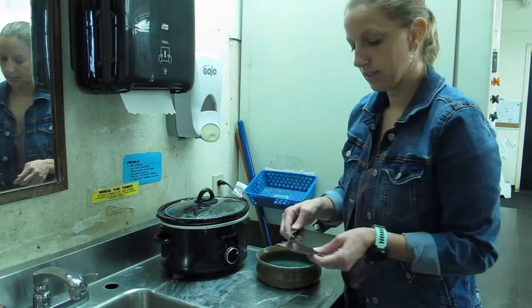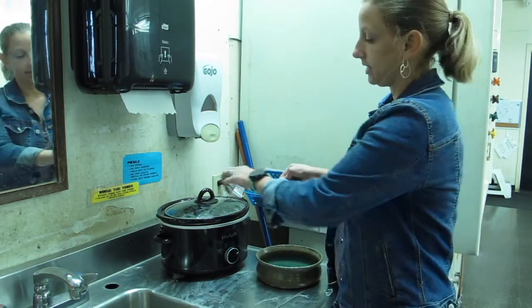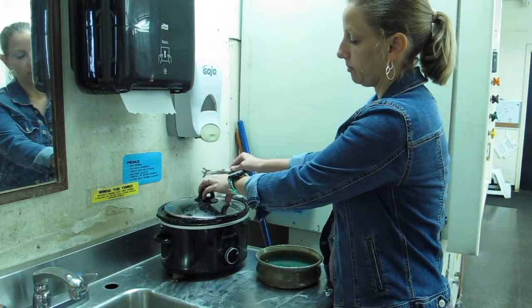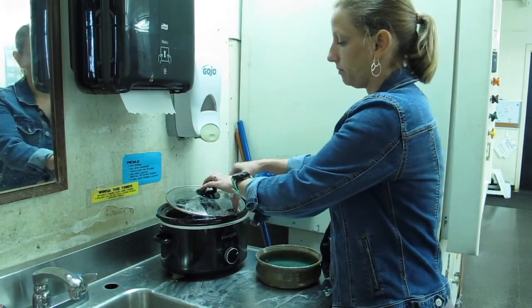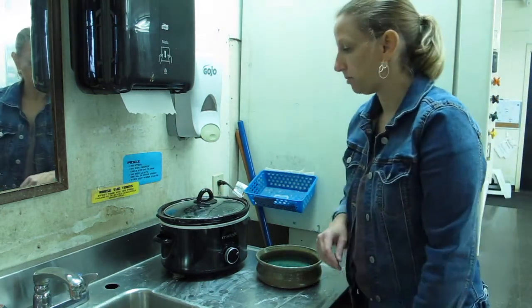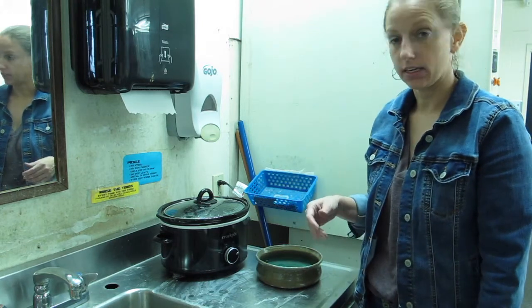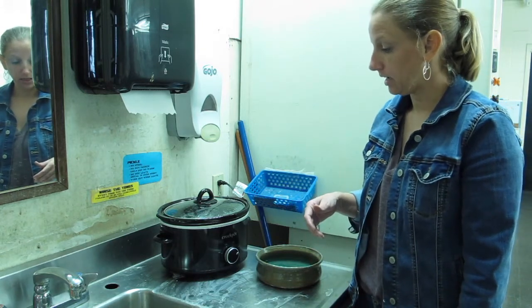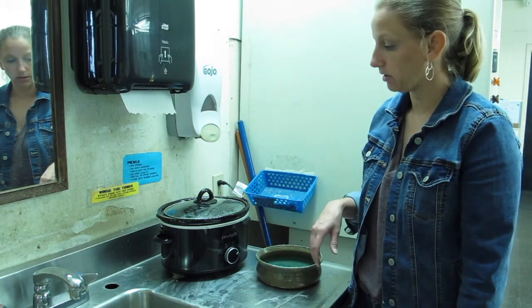I have my two pieces out of the quench. If I'm not wearing safety glasses, I'm going to drop them in behind and have the lid block my face. This is our pickle — it's what's cleaning our metal. It's a light acid: sodium bisulfate. It's going to stay in there for a couple of minutes, then we'll take it out, quench it in baking soda and water, scrub it a little bit, and then we'll be ready to go.